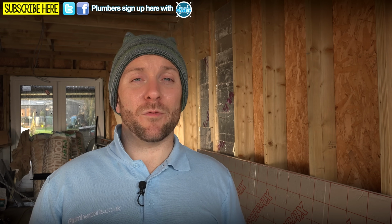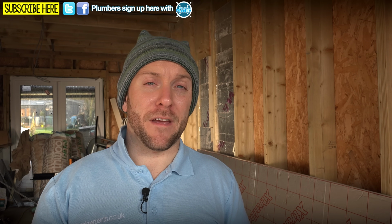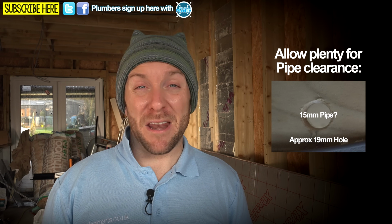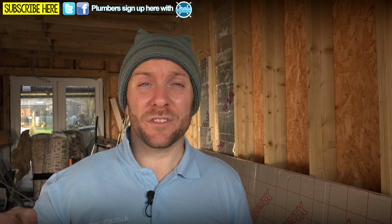Number one, the first thing I want to say is this. If you're drilling for 22mm pipe, say that's what you're first fixing, which is what we're going to be doing here today, we're also going to be running a little bit of 15mm as well. If you're doing either of those two, I generally err on the side of going at least 4mm bigger than the pipe that you're fitting, hole size. So if you're fitting 15mm pipe, then it's a good idea to find a 19mm hole saw minimum, really. The reason for this is ease of use. When you've drilled all your holes, you can pull your pipe through real easy, and it's not clagging on the hole because it's too small.